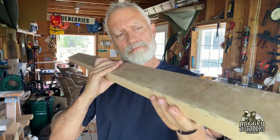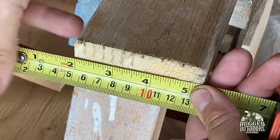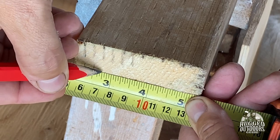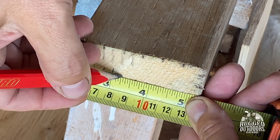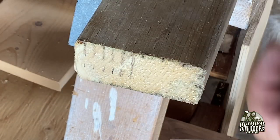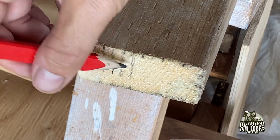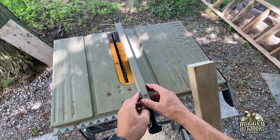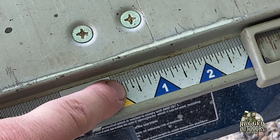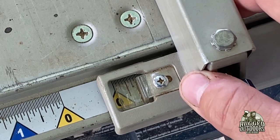My shape looks pretty traditional for a bent shaft paddle. I got a piece of 2x4 — you're looking at about five and a half feet, though the total you need might be 10 to 12 feet. On the end of the five-and-a-half-foot piece I did six measurements of a quarter inch — this is going to be your shaft. These thin strips will bend enough to fulfill that 12-degree angle. Once measured, rip them on your table saw; set your measurement to a quarter inch and don't go any thinner.